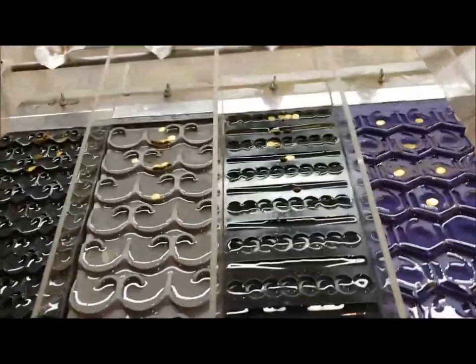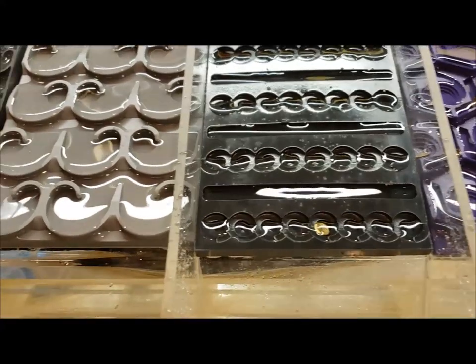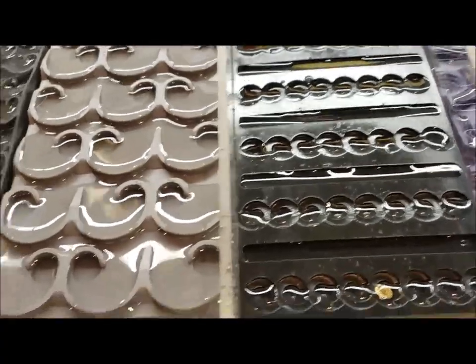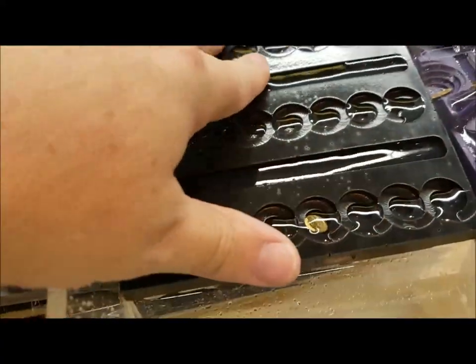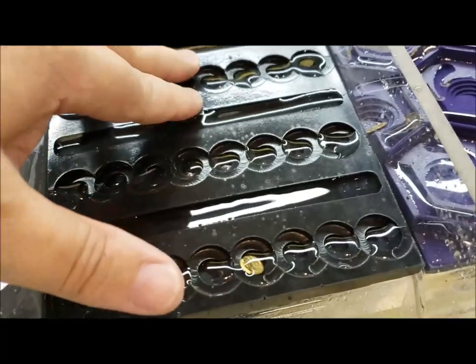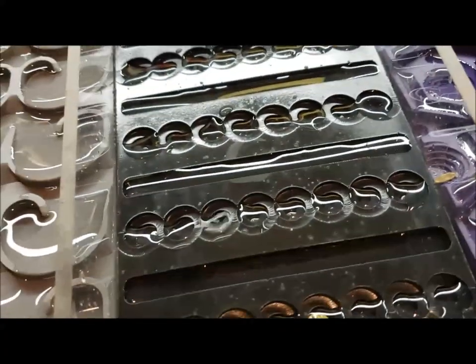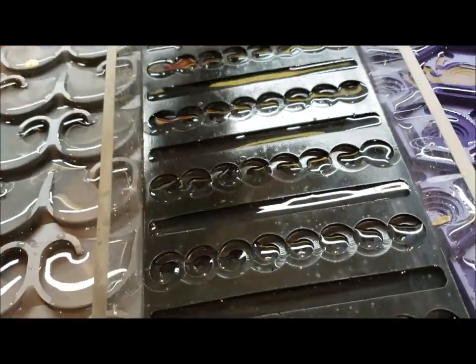All right, so there it is, guys. You can't help but to see how even when it's got all this space and it's not even overburdened and it doesn't have rocks filling up the voids trying to exchange, if all the space is available and it was running at its optimum, we have a system that flips out the flat big gold. And the reason it does in physics, if I was to explain it, which I'm not trying to beat up on anything, is you can see it's got more flat surface area almost than it does area for catching stuff. And everything else is down below. So this mat actually is the mat that's going to overburden the fastest, because it's going to fill up, plane out, and it's just physics.